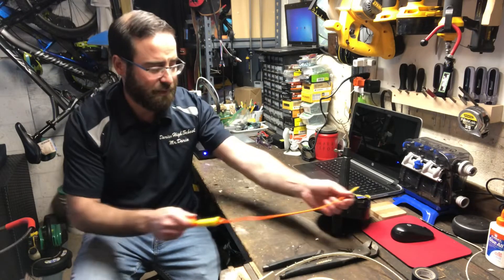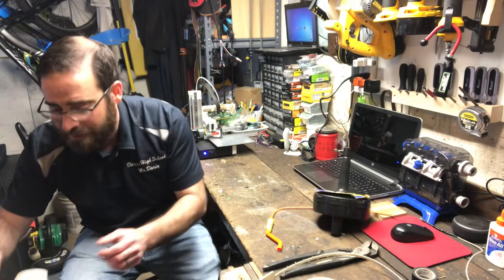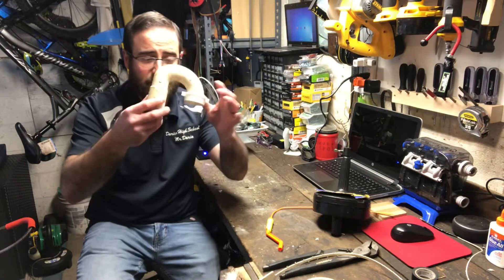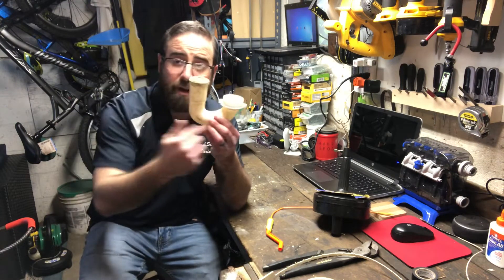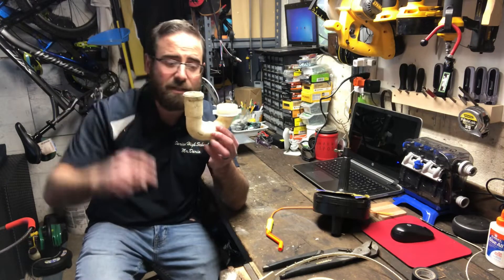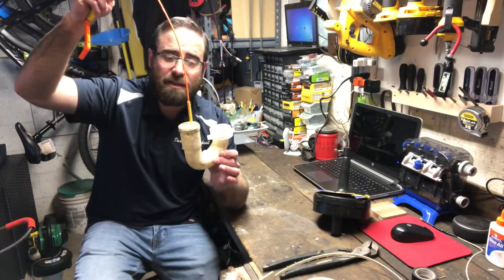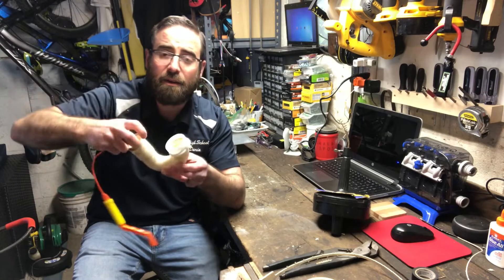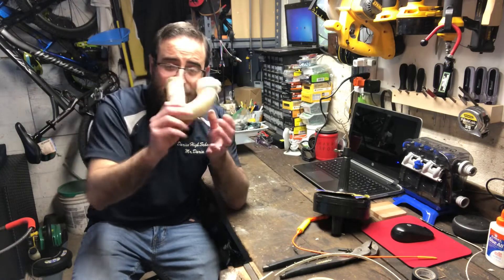So far we have a lot of things that will clean out drains. This here is off an old sink — it's a P-trap, because it's kind of shaped like a P when you have all the parts to it. It traps water underneath your sink so gases from the sewage don't come back into your house. A lot of times this is where things get clogged, and this is where you would send one of those drain tools through to help clear the clog.